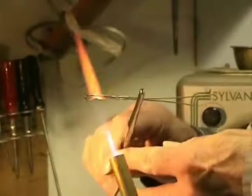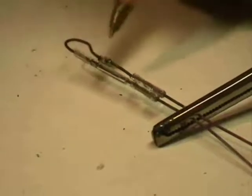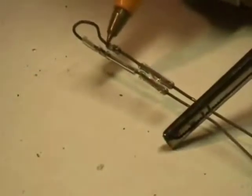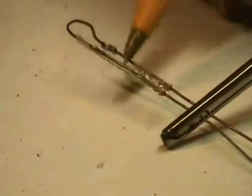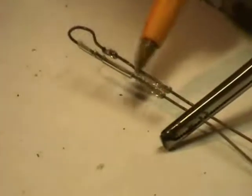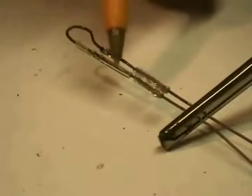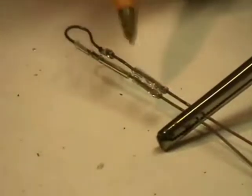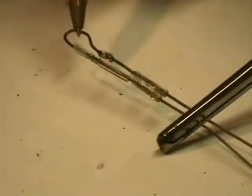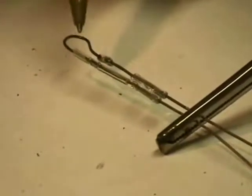I have my assembly now with the two tubes previously sealed to the wires, some insulating glass, and down here a small glass tube with a gap in the middle so there's no connection between the filament wires. I'll melt the glass on this middle one and have the rigid join I want. Here you can see the little glass tube melted on to seal these two wires together without making any connection between them. At the back are more glass tubes which will insulate the grid because the grid is going to go around both these wires.